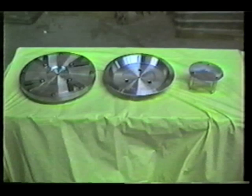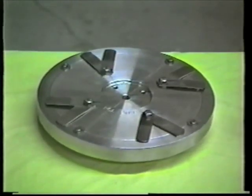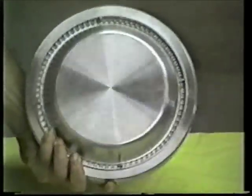A bottom crust making die set is manufactured to match a particular pan and consists of a lower half, or nest, an upper half, or punch, and a pan lifter which sets inside the nest. Bottom crust dies are available with a variety of decorative edges.